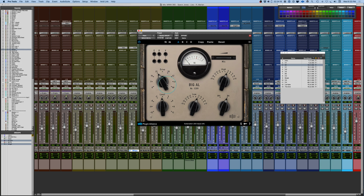There's certainly a lot of variation of tone that you can get by driving things in more or less aggressively, working with the different low and high frequency Baxandall EQs, the mid-range emphasis, which really seemed to work amazingly well on the kick drum, and the ability to drive the bass more specifically, work with more even harmonic distortion. It's the combination of all those things. It's kind of a cool unit.